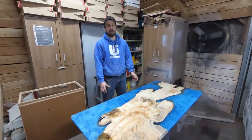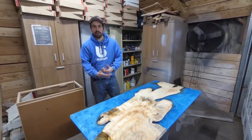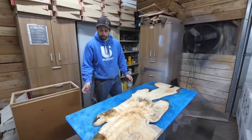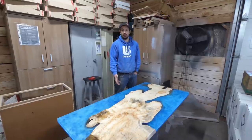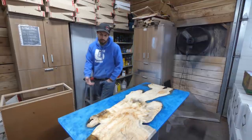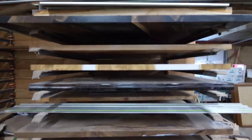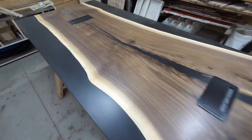This is one of the last of the Chemtech desks we're doing. This one we're spraying with a water-based lacquer. James — one of our employees who just graduated high school — we're really trying to show him the ropes. We're showing him the process of spraying, just putting down the first sealer coat, going through the training stages. We'll keep going throughout the day — scuffing it back, spraying a coat, scuffing, spraying — probably three or four coats today. This is the sixth desk they're getting; the owner himself is getting his own custom-sized desk, which we're about to pour, and they're also getting the big conference table with two electric boxes put into it. Total of eight tables — we're pounding them out and they'll be done soon.